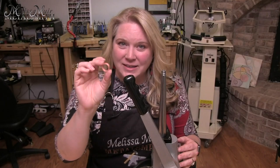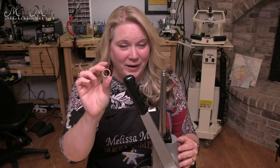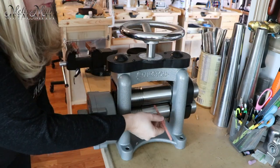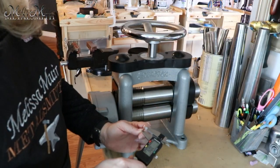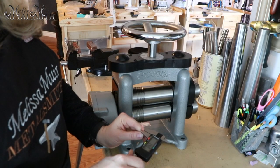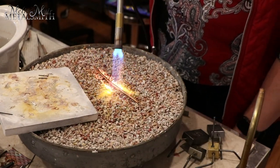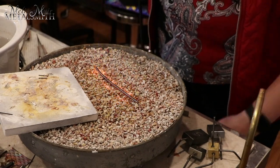There are other ways of resizing those rings, but what we do have is something that will reduce and stretch a simple band. So I took some six gauge copper, and first I rolled it down in my rolling mill. I rolled it lengthwise to elongate the wire — I started off with about four inches and took that out to about five, five and a half inches. Next, I annealed it, quenched, pickled, then came back to the rolling mill and reduced it further. Then I formed it into a ring and soldered it closed. We're about to test these seams.